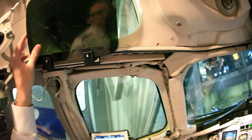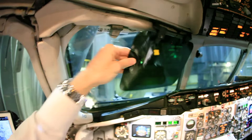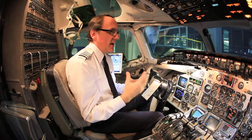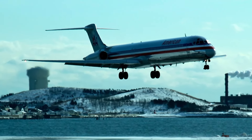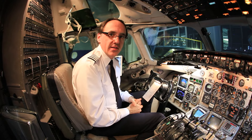I like the window shape — it folds down and can move all the way across to the other pilot's side. Probably one of the nicest features is that the airplane is very quiet. We're so far away from the engines in the back that it's almost like flying a glider. It's also really good in a crosswind — it handles well, has plenty of rudder authority, and does well on slippery runways. The only disadvantage is the nose wheel is a little light, so you need to push some forward pressure for nose wheel steering on slippery runways.